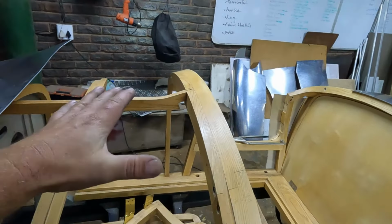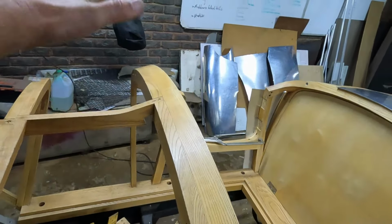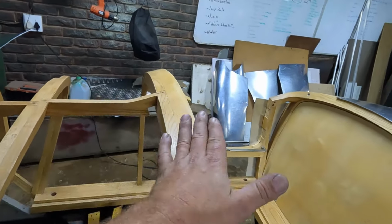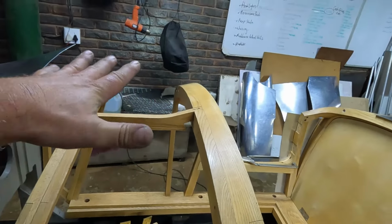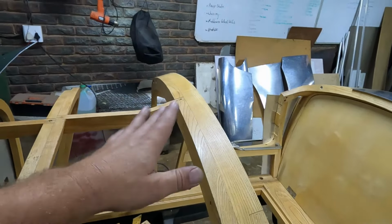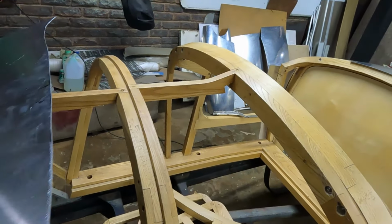And if you try to make that, you gotta think in reverse. Instead of just pumping the inside up and getting it to form around the shape, you gotta consider that the inside needs less material and the outside's more. So you gotta pump out the outer edges to get that Pringle type of shape, where the inside's basically what they call a reverse. Now guys, I ain't any good at this, but I've started making a panel.